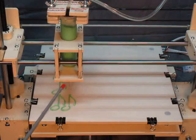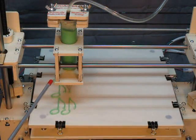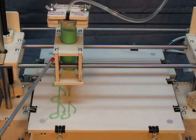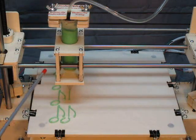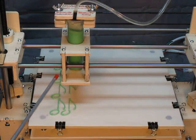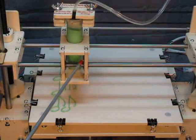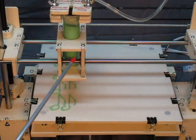These steel rods control the motion of the icing head by moving it. It can only move in a certain pattern. You can only move along the rods. And to make that move smoothly along the rods, you have bearings, and these bearings are located at various points in there.